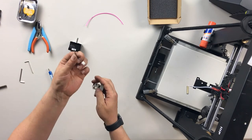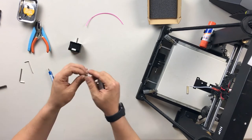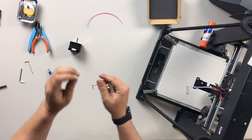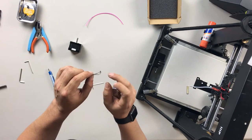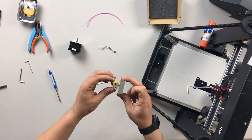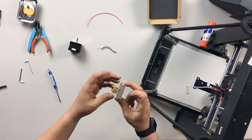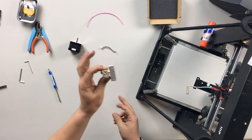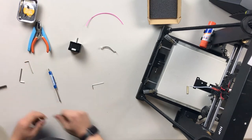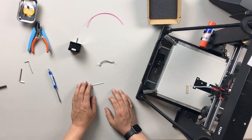There's our thermistor. Take very good care and caution that you don't bend this too much — that's glass on the end there and you do not want that to break. If it does, you're not going to have a working unit. This is the heat block with the heat break, and we can set this whole thing aside — we won't be using this again. We're basically just left with an element, our thermistor, and the stepper motor.